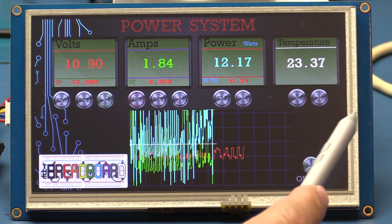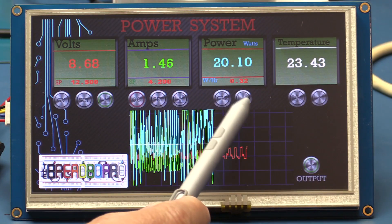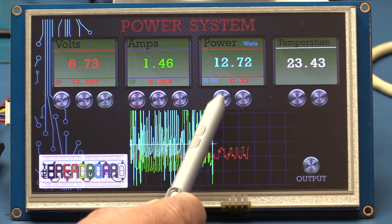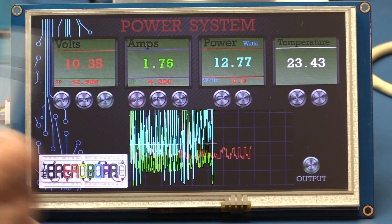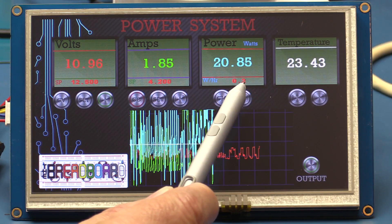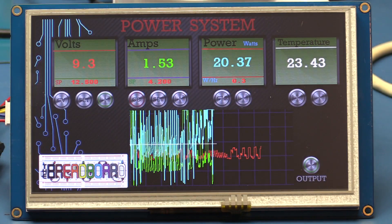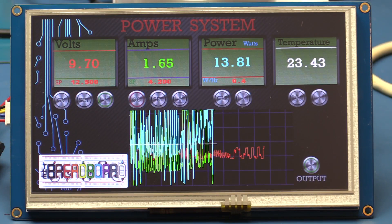The temperature has an alert button — not coded yet — and a graphing button. The power display has an accumulator for watt hours that I can clear by pressing a button. If you set the two analog inputs to the right scale — currently assuming 0 to 5V in — and use a shunt resistor with appropriate voltage dividers, you could monitor a battery discharge and accumulate the power drawn from it as well as instantaneous power.